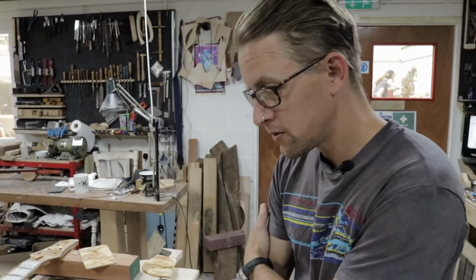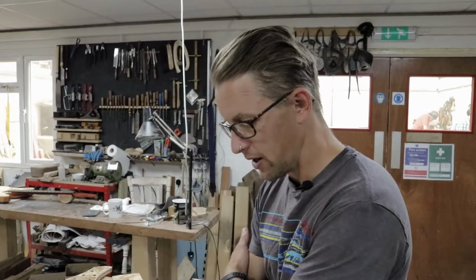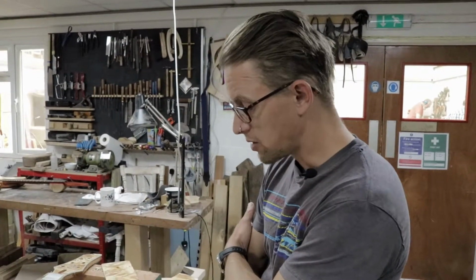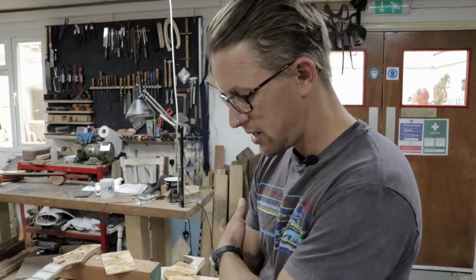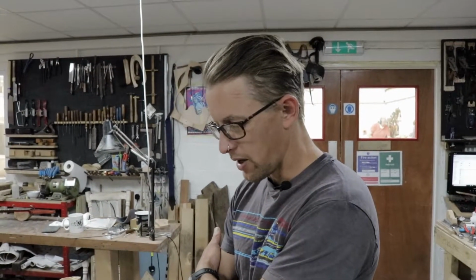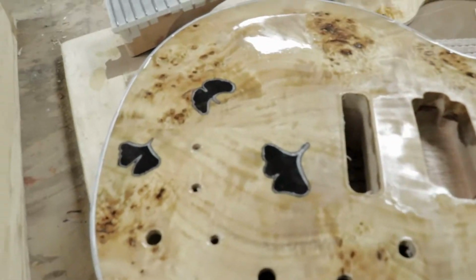Well, I mean, that would stain. Dust. Oh no, you talk. I was talking about epoxy still. Yeah. And filling it that way. That would probably be the easiest way. You could do super glue and dust, but I would suggest white glue and dust, so just normal woodworking glue and dust. And that doesn't stain actually, which is a benefit.